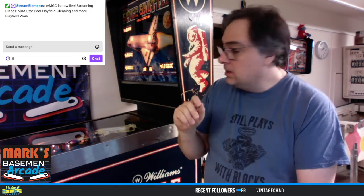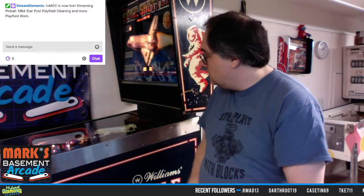There's a video on how to bulletproof a Williams 3 through 6 board that Dave Brennan did from Dave's Arcade. Check Dave's Arcade out on YouTube. He puts 0 ohm resistors and a bunch of other things, which takes away the heat from the board for all the GI and also makes the switches register better. So if you do a quick hit, it will register it because it can detect that. So I will be doing that to the board.